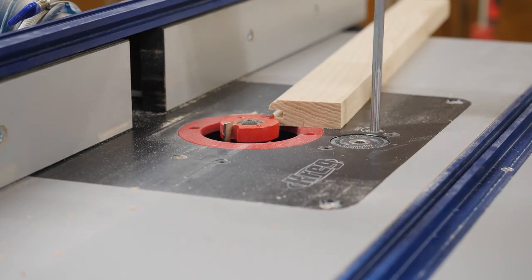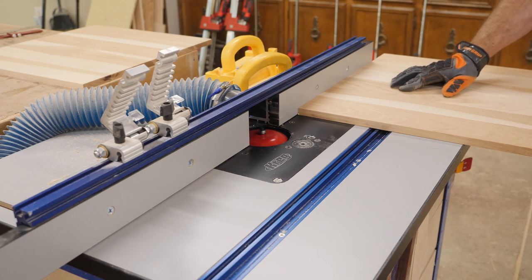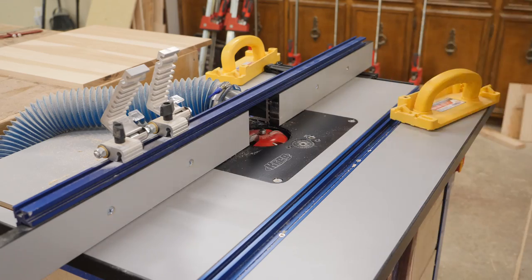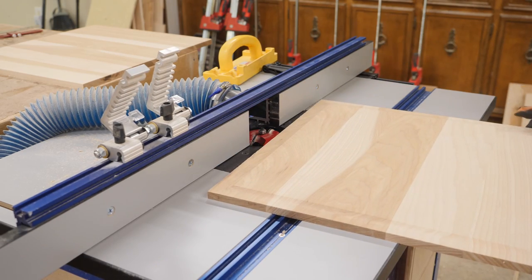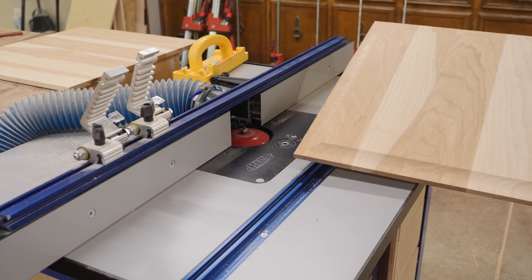This next step is only necessary if you're making doors with glass inserts instead of a wooden panel. With the same bit still in the router I lower the cutter until it's just shy of the top of the groove and run all the rails and stiles necessary for the glass insert doors. With the panels out of clamps and planed to final thickness it's time to cut the raised panel profile. This needs to be done in a series of passes — if you try to cut the profile in a single pass you'll likely damage your panel or router bit. I cut the profile in three to four passes depending on the wood species and profile being cut. If you start by cutting an end grain edge first and then rotate the panel 90 degrees counterclockwise after each pass you'll be less likely to chip out the end grain, since there will be side grain material to support the wood being removed as the bit exits the back side of the cut.